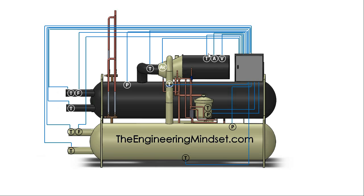The controls part for the motor will also record the run hours and the amount of starts, and it may record the run time since the last service. Most chillers can only start a certain number of times per hour, especially these large ones — and that's to protect the machine again. The inrush current into these motors is extremely large, so if the chiller was able to just turn on and off repeatedly, you'd blow all the circuits in the motor, through your bus bars in the control panels, and that could feed all the way back to your transformers — potentially blowing your entire electrical circuit in the building.